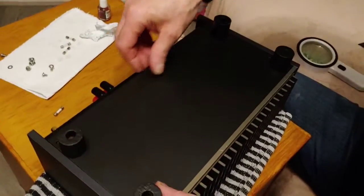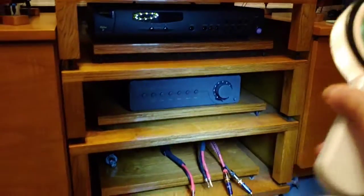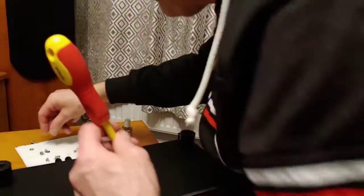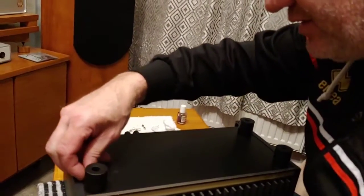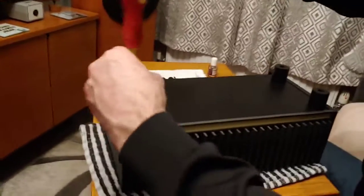They were perfect but just a bit too big for the screws to get in place. If you've noticed, I've re-sprayed this case of the 405 and matched it exactly the same color as my QC24 down there. It's spot on — all it was was some car paint from Halfords; I took a sample and matched it up really well. I sprayed it and then gave it a matte lacquer afterwards, because with metallic paints you need to lacquer them otherwise the metallic wears off too easily.